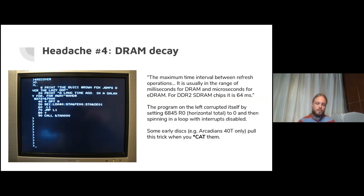Whenever you're doing a loop whilst the video chip's in a funny state, just work into that loop something that just iterates across a bunch of RAM addresses, and you'll be fine. If you don't, you will not be fine, and you may even regret it.